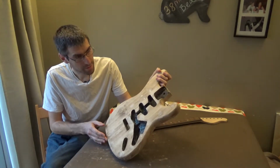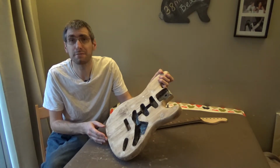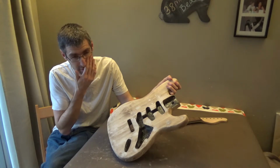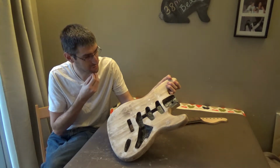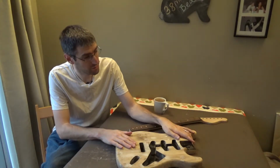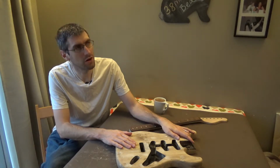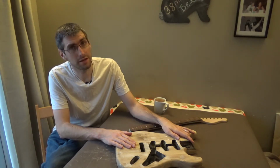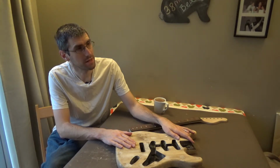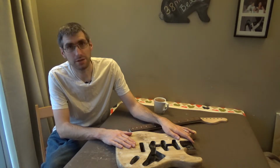So I bought a trusty, inexpensive heat gun with 2 heat settings, and set about melting the coating. First of all, as I tried to be nice to the environment, I bought a paint varnish lacquer stripper that supposedly had no solvents, no bad stuff, no fumes, which made sense. I liked the idea of it, but it turned out it didn't really work. I just wiped it on, left it on for a bit, and it didn't really do much. So I ended up using a heat gun.